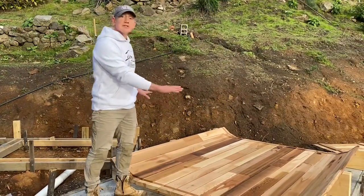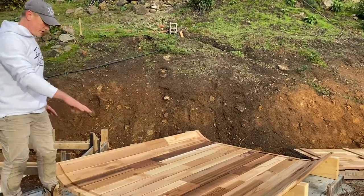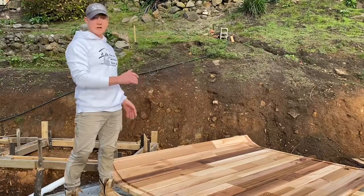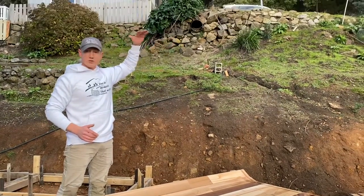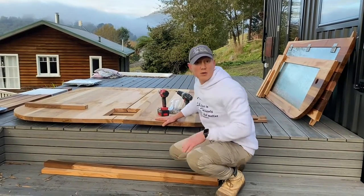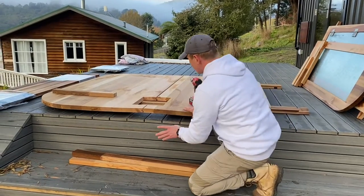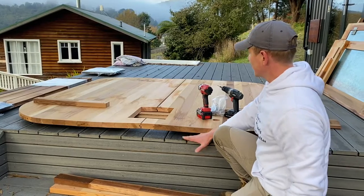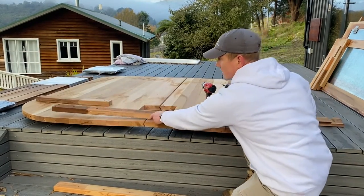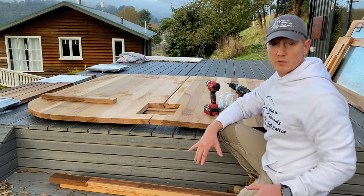Now that the bottom section is completed, we can start to assemble our walls. We will focus on the back wall first — it consists of two pieces joined together. The front wall consists of three pieces: two glass panels and the door. Once the walls are assembled and in position, we will temporarily secure them with a couple of staves going across the top while we continue assembling the staves through the side. We put the back wall panels with the outside face down on a flat area, joining them together and securing with the supplied planks — one at the bottom and one at the top.